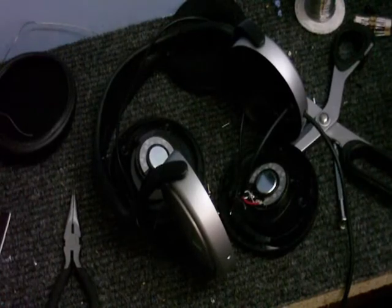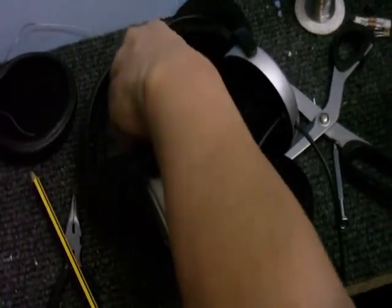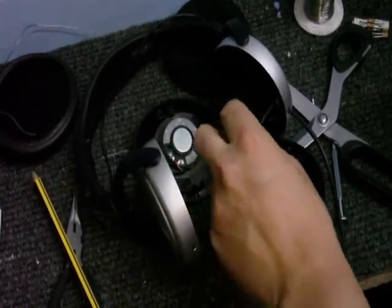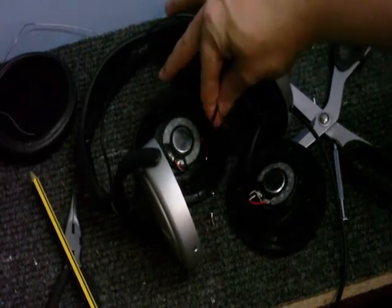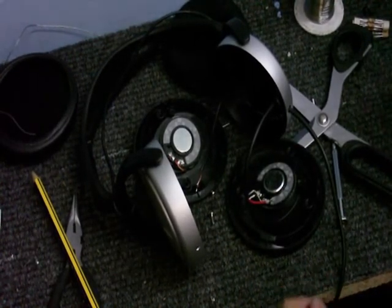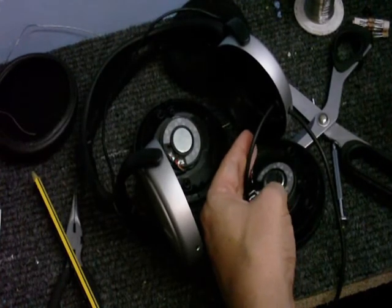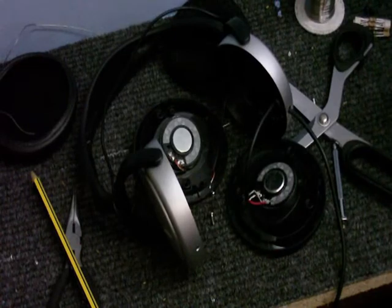Now a lot more later on into the build. As you can see, I've now put a cable onto the right headphones. I've used the original headphone wire, which is this horrible enamel coated stuff, but I can usually burn that off with the soldering iron — and that's what I've done there. So I've just got to connect up these wires here and close it all up, and then wire it into the volume control, and we'll see how well they work.